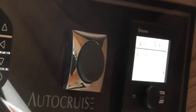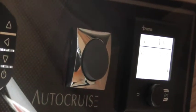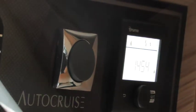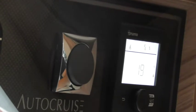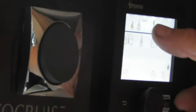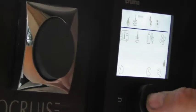So if you've got the heating going on at the same time, obviously it doesn't want that because you're drawing the heat away from the boiler. Yeah. So it'll shut the fan down for that period of time. So all it is, obviously, to increase the temperature in the water quicker. Okay. Again, it's showing boost. Obviously, it's flashing on boost because it hasn't reached temperature yet.